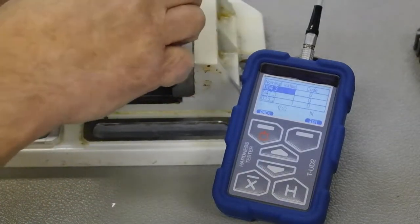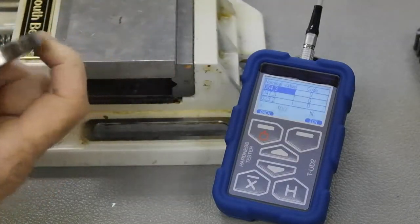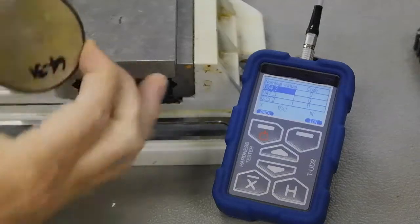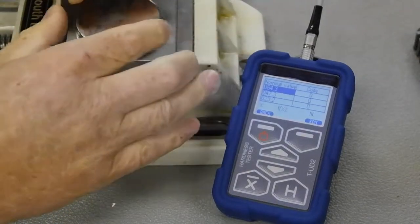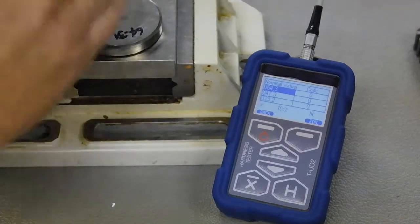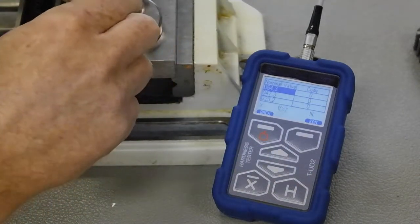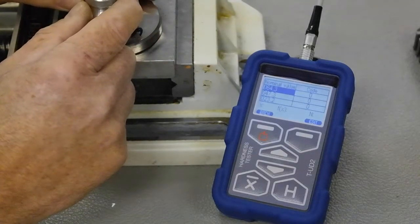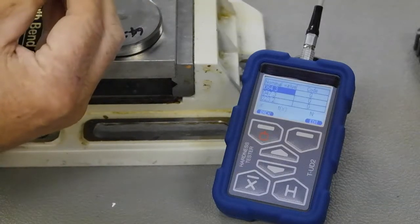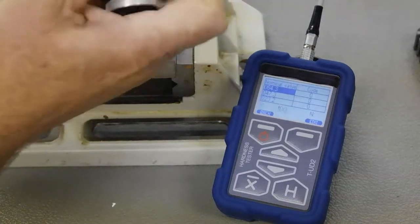Now I'm just going to scroll back to the top because I'm going to start with my hardest block. It really doesn't make any difference so long as you have the correct block on your part. I'm sort of ringing this to the block — what we're trying to do is make it as homogenous as possible. Because these are relatively thin, we want it to be seen as one solid block of material, as close to it as possible. When I do a test you'll see these are all now zero.